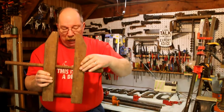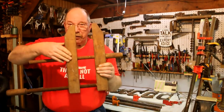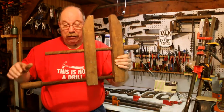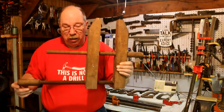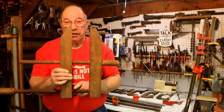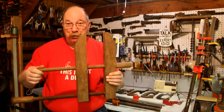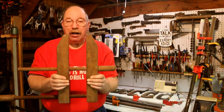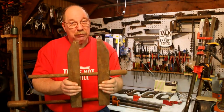This side is just a pass through. This side on the bottom is just a pocket. So this side over here has the threads in it. You can buy threading dies to thread the screws and taps to make the holes, and you can make as many of these things as you want. Just get yourself a piece of hickory — it makes really good threads. Maple works well too. Make as many clamps as you want. Nice design, good reach, plenty of power, great for woodworking. I wouldn't necessarily call this a welding clamp — it would work, but I wouldn't call it that.